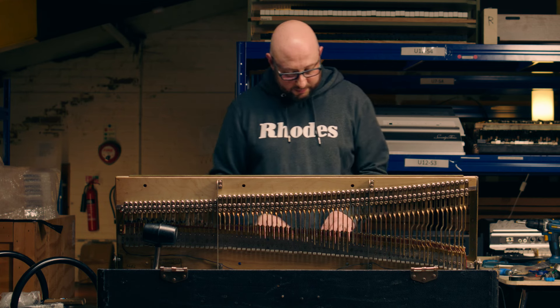Once that's done, recheck all your key levelling along the front and make sure everything looks level, which it pretty much does now. It's an iterative cyclic process so you have to keep checking and tweaking, but you will get there.